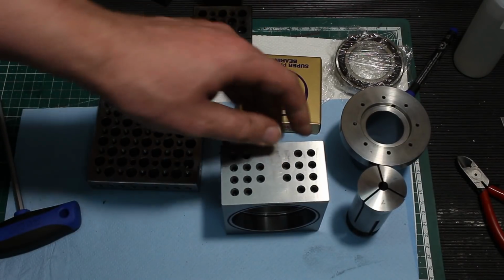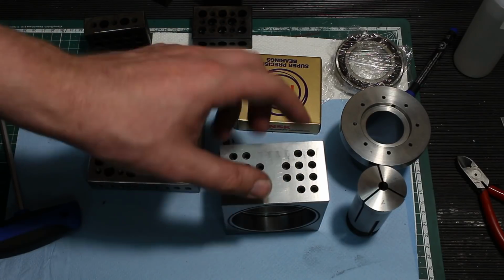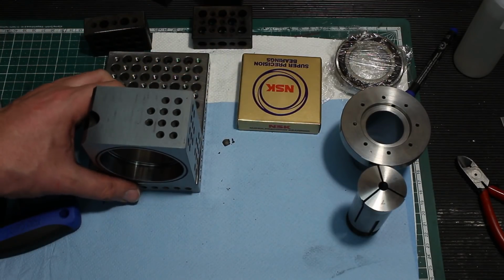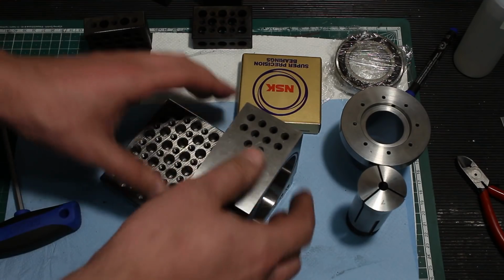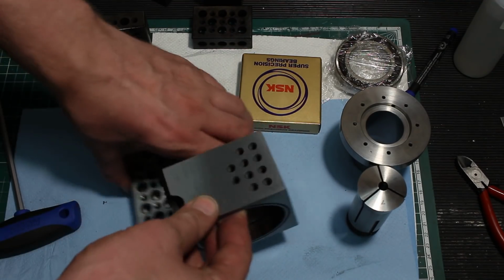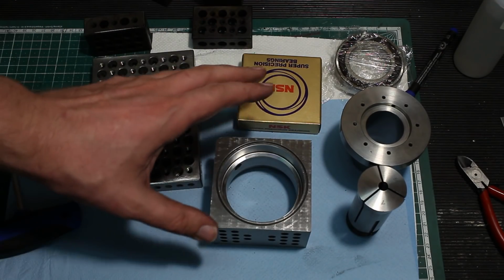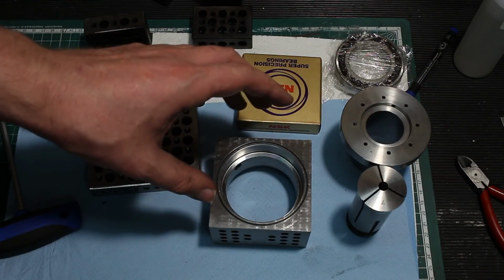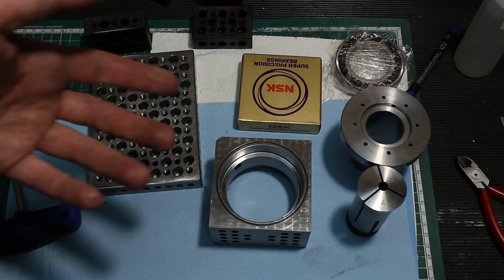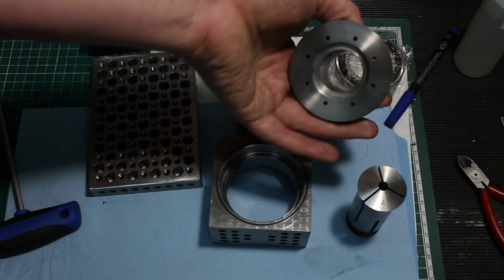The housing has the same 6mm threaded holes on a 10mm pattern, so I can bolt the spindle, for example, to this plate and have this sit on the magnet of the surface grinder off the table even, and do cylindrical grinding with it. It will have an indexing plate for 36 divisions and an O-ring drive, so I can do motorized grinding with it.